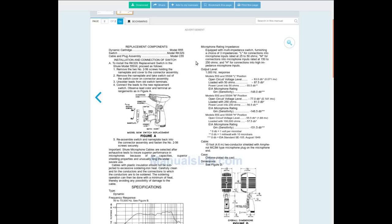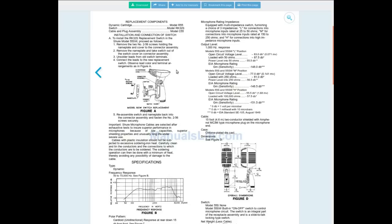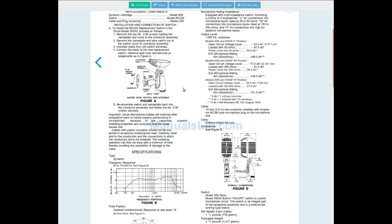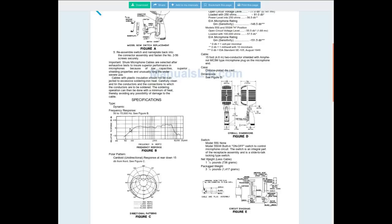So here we've got the general specs, some replacement parts and whatnot. Down here we have the typical frequency response chart and the cardioid pattern — this is looking from above. Most of the sound will come in from the front; there's a little blip at the back but that is 10 dB lower than the peak at the front. Here's the frequency response on a logarithmic graph — it's relatively flat from about 125 Hz up to about 1,100 Hz, then it bounces up about four dB higher until about 1,600 Hz, and then it craters right down to 10,000 Hz.